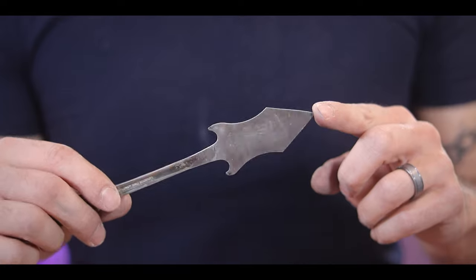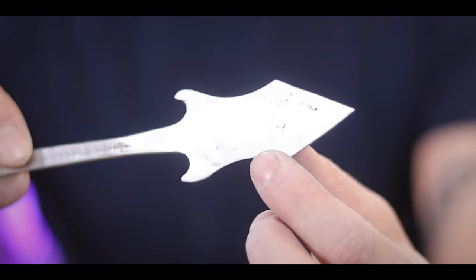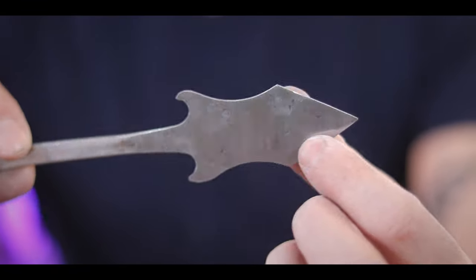To clean up the rest, I tore off the paper from my pattern and hit the face with the grinder to smooth everything out. This made it nice and shiny and smooth looking, but I noticed some little divots from where I hit with the hammer unevenly. Were it a much thicker piece of metal I could chase those down with the grinder, but because it's already pretty thin and I want it to stay strong, I decided to leave those divots in place.